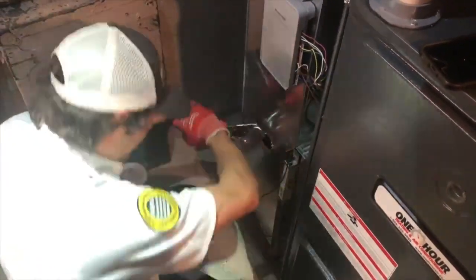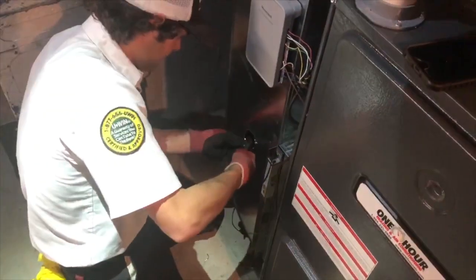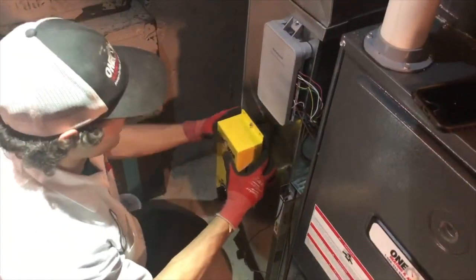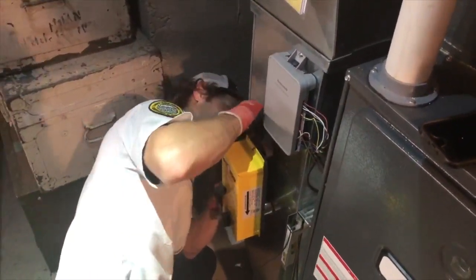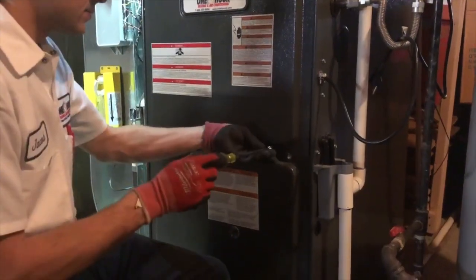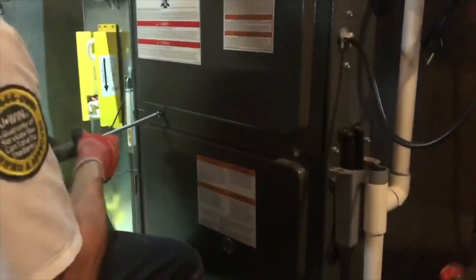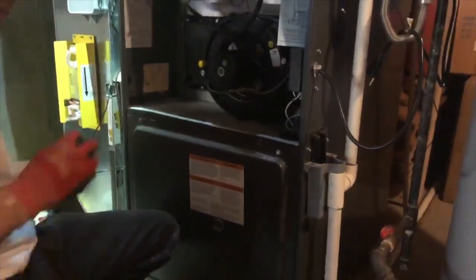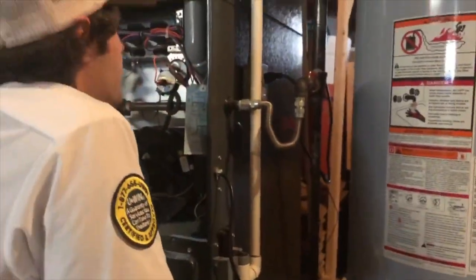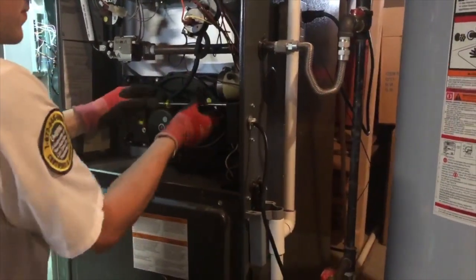It's actually 32 inches of bulb, and it inserts into the ductwork here. The bulbs we use — this piece of equipment is second to none that you can get for residential use. These bulbs are extremely powerful as far as their wattage goes for sterilizing and killing germs, bacteria, and viruses. He's going to be opening up the furnace — we're actually tying this into the furnace, so it's going to operate powered by the furnace, simultaneously with the furnace.